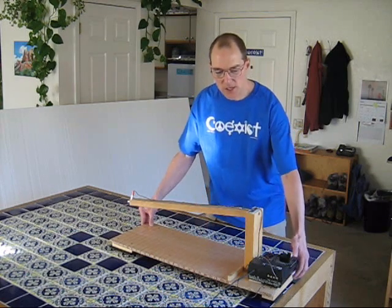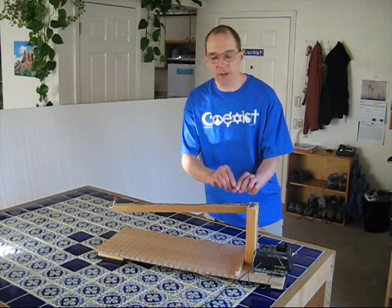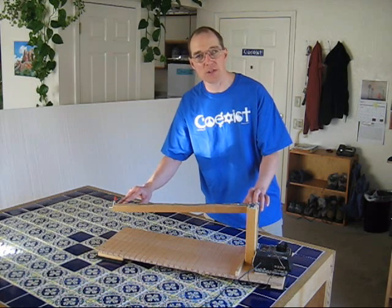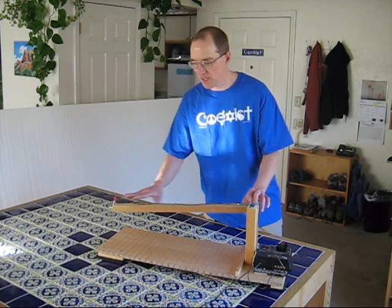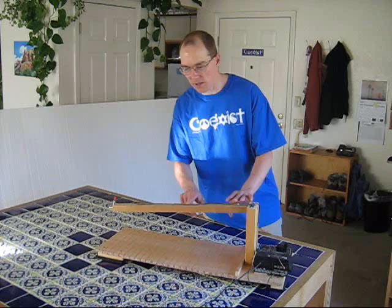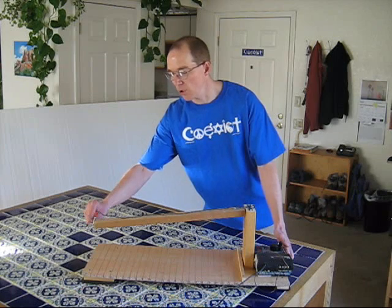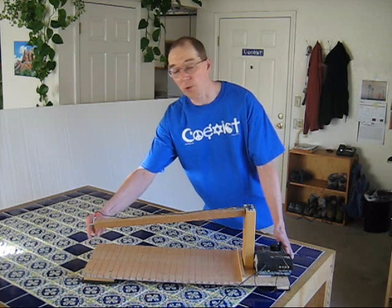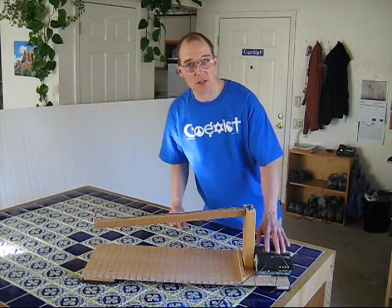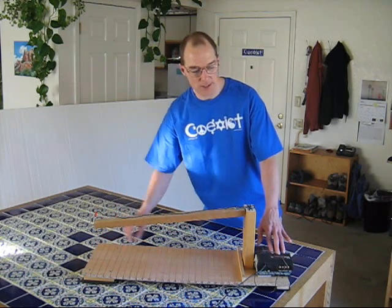You can see here that I've used a long piece of wood instead of just an aluminum-type post that they used in their design to get that 24-inch length. My electric wire is stapled to the top of the piece of wood. Down here on the end is the little piece of aluminum post that I need to hold my wire. This is my hot wire, and this is the train transformer. When you turn that on, this hot wire does get hot.